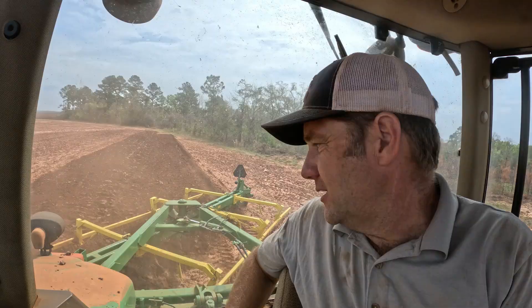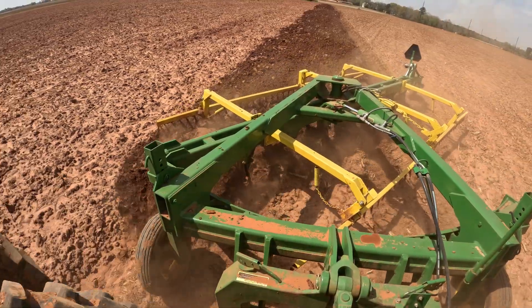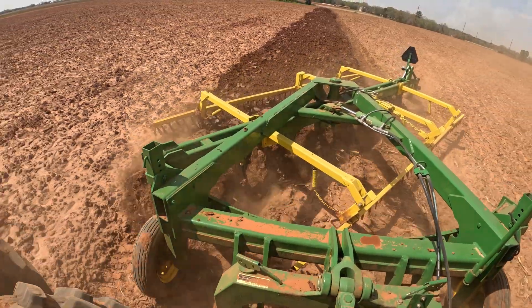When I'm plowing with the tractor I'm only going to burn about 100 gallons of fuel a day - about 80 gallons less than when I'm subsoiling. The tractor isn't under as much load pulling this plow even though it's an eight-bottom plow. I can pull it faster, but it would throw the dirt too far and leave the field uneven. I'm running 3.7 mph right now; I can pull it as fast as five in some conditions, but with this red dirt and current moisture, about four miles per hour is where I want to be.